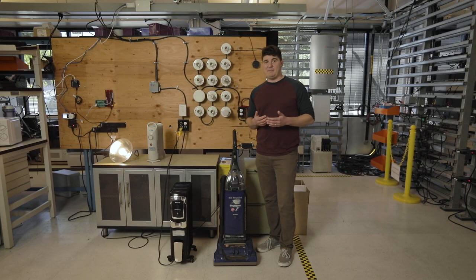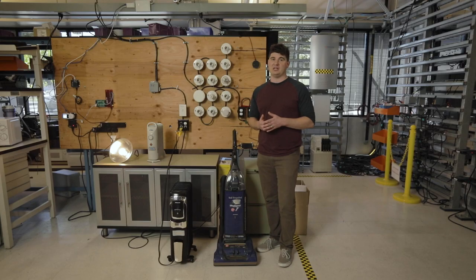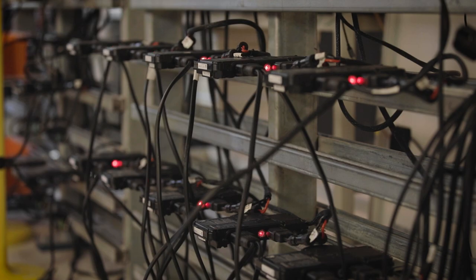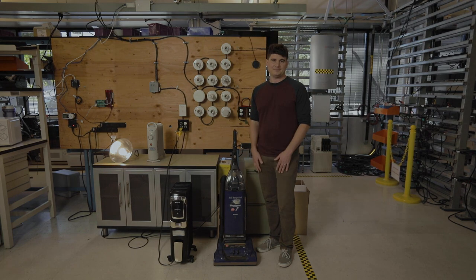So what we saw here is what happens when you simply try to draw too much power from the PV. The voltage collapses too much and the system decides to shut off. You can see that the system is designed to automatically restart. So as soon as you remove the load that caused the blackout, the system recovers instantaneously.